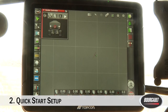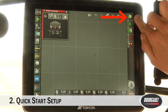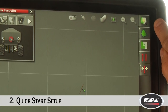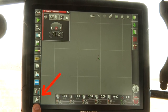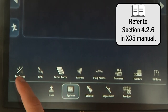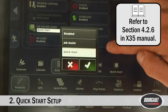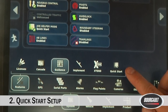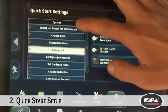Step two talks about quick start options. Our quick start button is in the top right-hand corner. Quick start drives you through a sequence of events every time you enter a new field or push that button, and I'm going to talk about how to optimize it for your season. Touch the wrench in the bottom left corner, go to System, Features, Guidance, and then Job Helper Mode — make sure Quick Start is turned on. Then go to the Quick Start icon, where you can change the sequence of events for quick start every time you push that button.